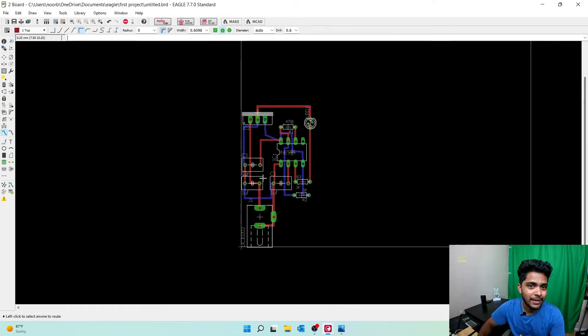We routed it very simply — we also did it with auto-route, which did well for this easy circuit, but for a complicated circuit like a microcontroller with many pins, auto-routing is a no-no. Route manually — you can adjust the layout as much as you want based on your requirements. But are all connections correct? Do they follow the design rules? We need to check the ERC and DRC, and I'll explain all of that in the next video. Thank you so much for watching — see you in the next video!